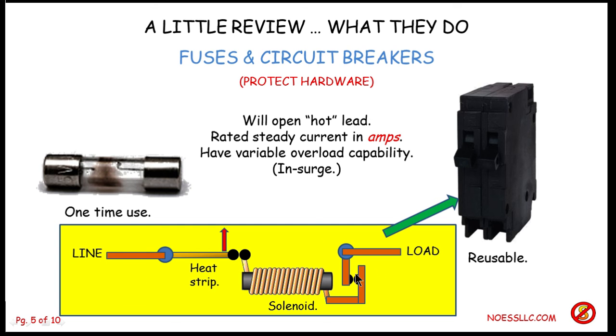Within this reusable circuit breaker, if you have a massive overload like a dead short out at the load, this solenoid will operate and open those contacts. If you're just slightly over the current value of the breaker, it will slowly heat up and then eventually pop open. And if you try to reset it back too quickly — it pops and you come out and try to push it back on without pulling off whatever the problem was — of course it'll pop again. These are reusable; they have several different ways of handling current overloads, either instantaneous high ones or a lower level but still too high, slower. So that's what circuit breakers do.